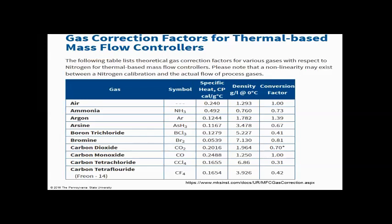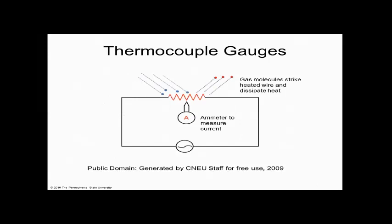It's more like a gauge I would use, in some senses, as a story, just telling you a story. It's a gauge I use for robotics and to control valves and to know things are safe. To measure a pinch of how many atoms I need to make something in nanotechnology, I'm going to use the capacitive manometer for that. So the TC gauge isn't as scientifically good as a capacitive manometer, but it costs probably 20 times less.